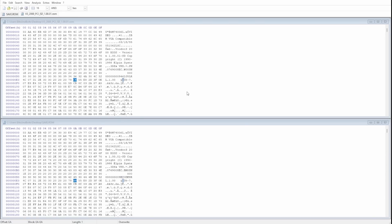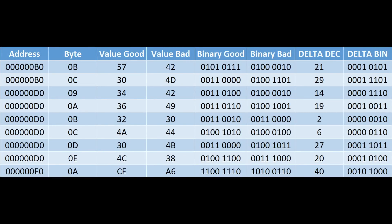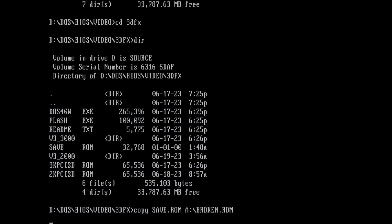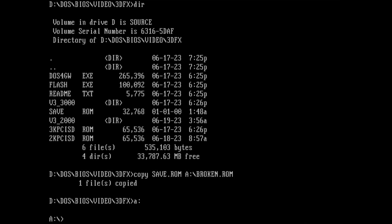I wonder if this is really unreliable data from an old BIOS chip, or just a regular version with a few updated values. Here is a summary of all 9 differences, their position, value, and bit representation. This is very different compared to the Synergy 2 BIOS, which looked more like 3 bits had actually flipped. Somehow I am not convinced that this BIOS is the root cause of no VGA output. I really wonder what would happen if I flash the original BIOS back to the card — the expectation would be to end up with no VGA output. Let's try that and see what happens.